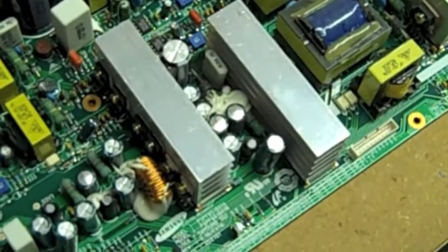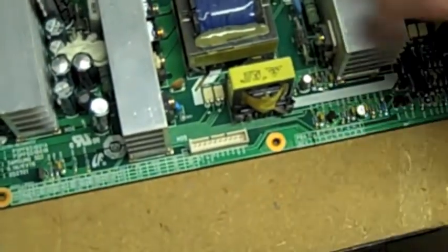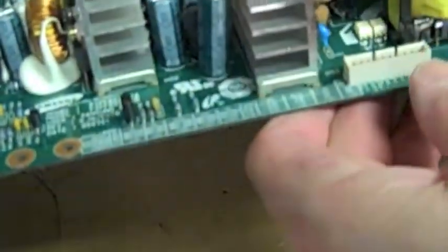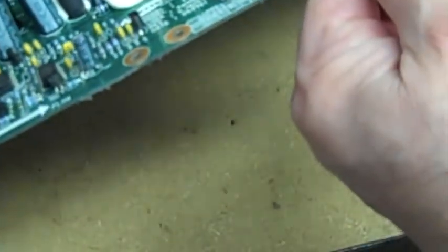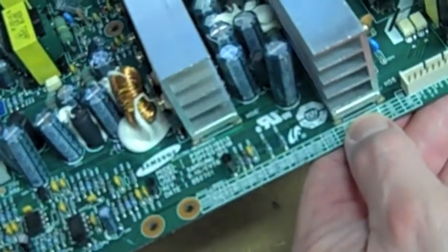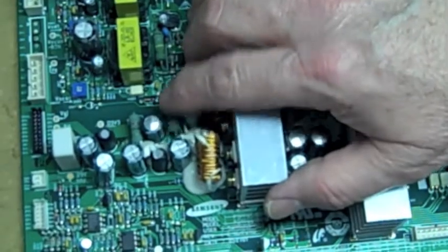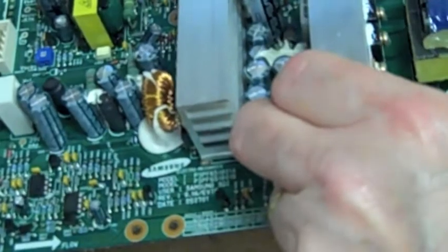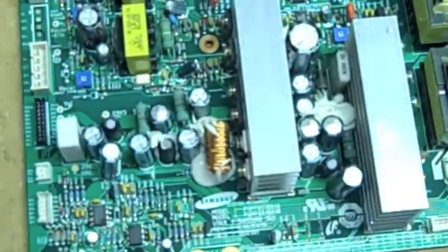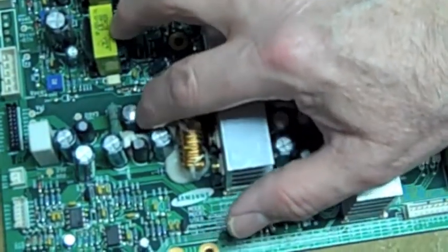Okay, we're back. And we got these two bad parts here. We found out these two are both 2200 at 10 volts, I think. Yeah, 2200 at 10 volts. And this one over here is a 470 at 35 or 25 volts. Yep. So we have these two parts here, but we didn't have this one,